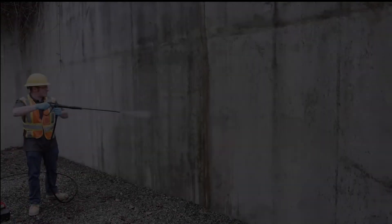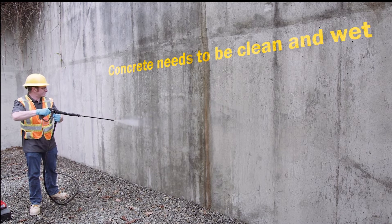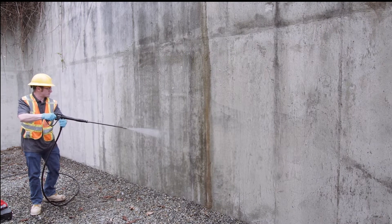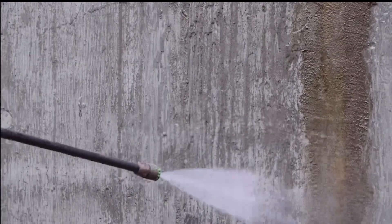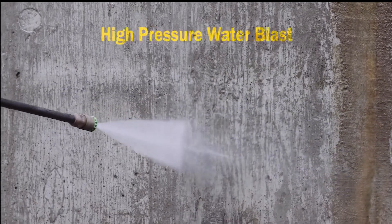Crystal T1 needs to be applied to a clean, wet concrete surface free of paint, sealers, form release agents, or any other contaminants. The concrete must be open pore and absorptive, such that water placed on the surface will soak in. Saturating the concrete is essential to your success.